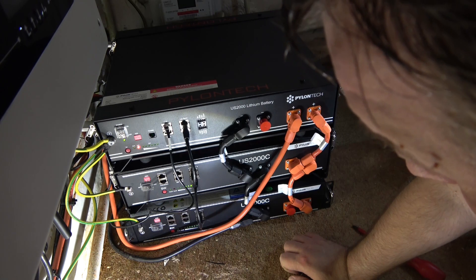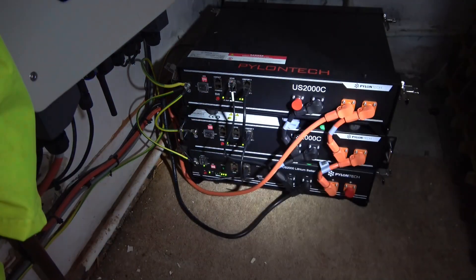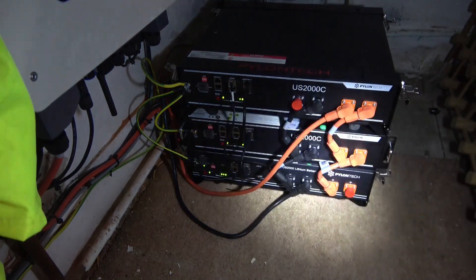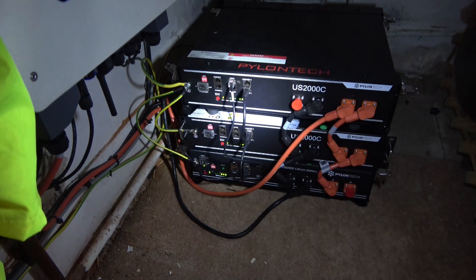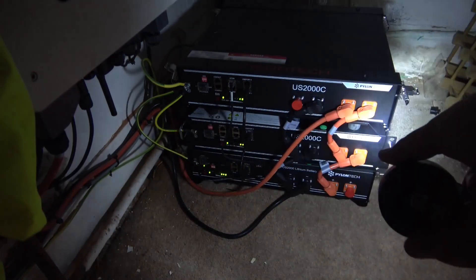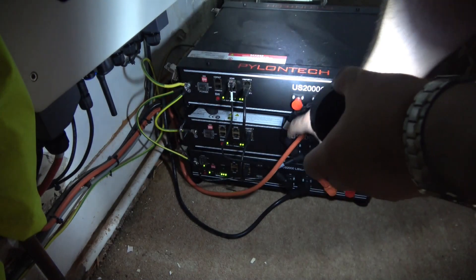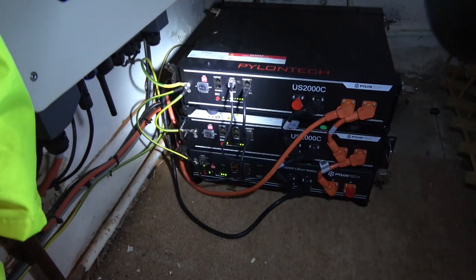By the way, if you've got a US3000C that will always go on the top of the stack. With the US2000B on top as master it didn't operate — it was alarming out — so I've swapped it around; it's now on the bottom. The master is on the top and I prefer it that way round. So here we go: an existing US2000C on the top, the CAN bus coming in here, then Link 1 going to Link 0, Link 1 to Link 0 all the way down. Parallel connections run right to left throughout, with the negative pulled out at the bottom and positive at the top, and the two extras blanked off.